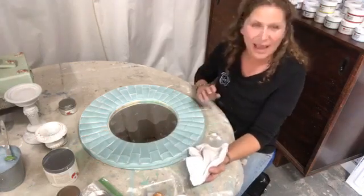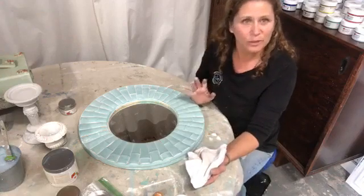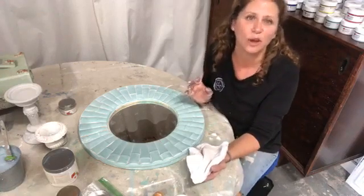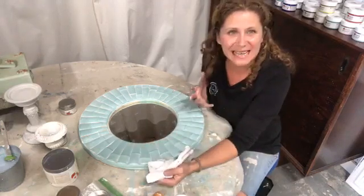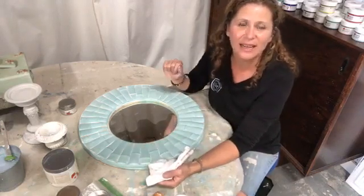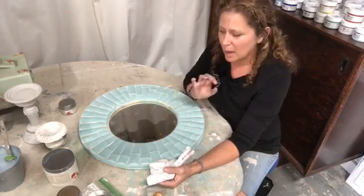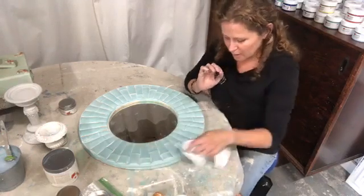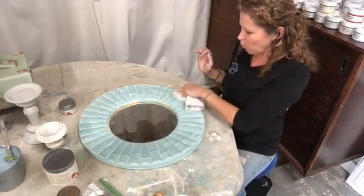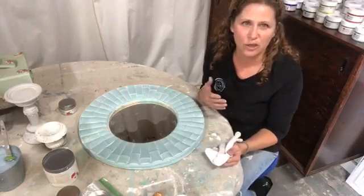that it's not really going to have a lot of traffic, I wouldn't put it on a dining room table. I wouldn't seal it with wax. I would seal more with a tough coat or a clear coat. You are going to be using it a lot, placing things on it. Even though wax is beautiful and it gives it a really soft sheen, but it is wax and it's a much more delicate finish. So I would use something more tough on pieces that are going to be really used.